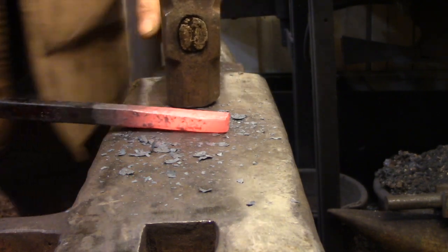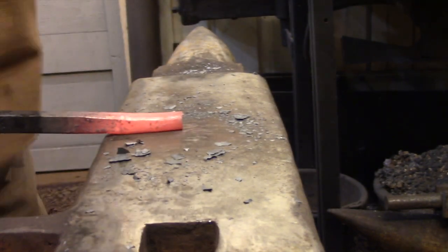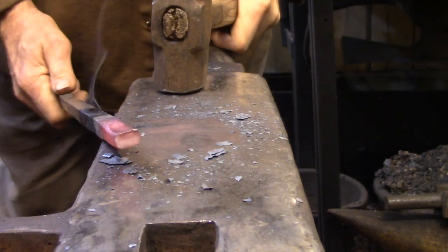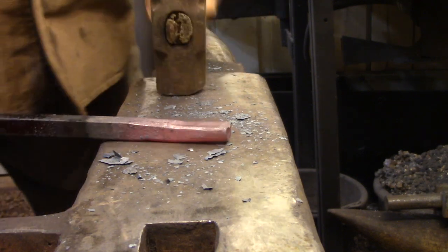If I wanted to flatten this bar and turn it into a rectangular shape with rounded corners, you're going to notice you'll have to really step up the amount of hammering needed to get this done. It's okay for short runs and making slight changes, but you wouldn't use this technique to make any drastic change to the shape.